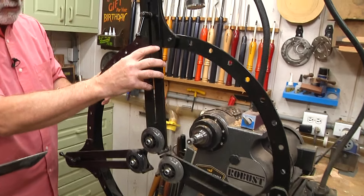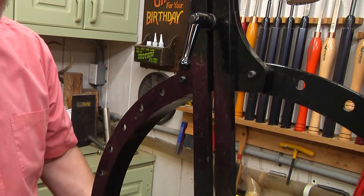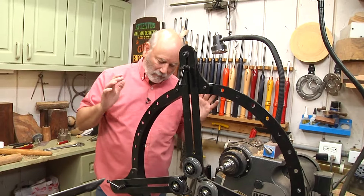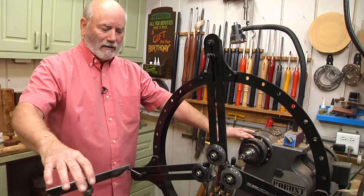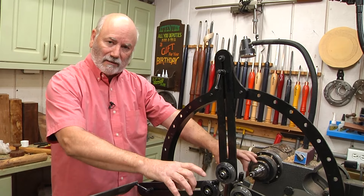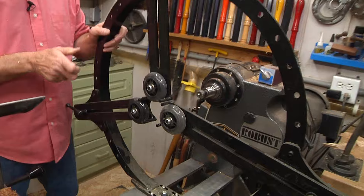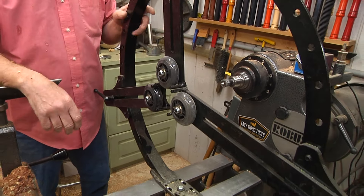It's made of steel. A cool thing is these arms — you can adjust them in 10 degree increments all the way around. So if you have a laser and it hits that, you can move it and change it for the shape of the piece of wood you have. It's incredible. Why do you need a center steady? Because the longer you get on a lathe, the more vibration is induced. It can be a big thing or a skinny thing — that vibration gets in there and you can't get a clean cut. This puts pressure on the wood and counteracts the pressure of your tool doing the cutting, and it reduces or eliminates completely the vibration.